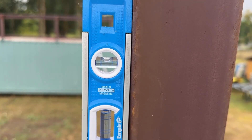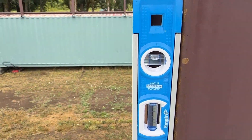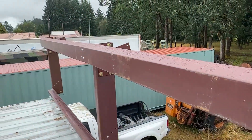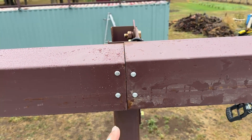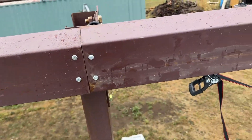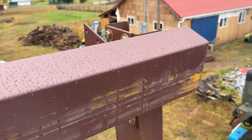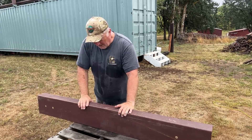I measured and every single one is exactly the same, so when I pull on this it's going to level all of them. I like it — don't believe me? Let's just check. I can continue all the way down to the end — they're all the same. What I did is I planned ahead. I leveled every single one of these columns exactly the same, and it was just a little bit off, so I planned to attach all of these at the exact same bubble and then pull it level at the end. Have a plan in place — if you fail to plan, you plan to fail. Once you get this side of the eave purlin nailed down, screwed down, and level, all you've got to do is bring your level over here and adjust this column. Once it's adjusted, screw it into place. This is the part of the video where you're going to have to start coping.